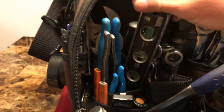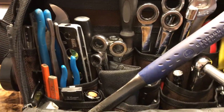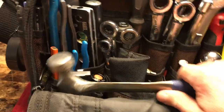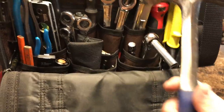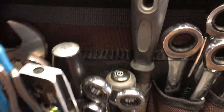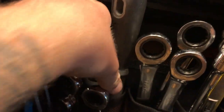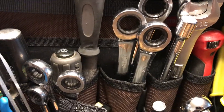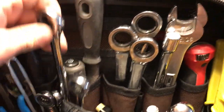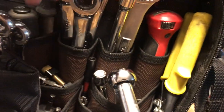I've got a pair of 420 and 426 Channellock pliers — the smaller guys — and those have suited me really well. I carry the Klein magnetic level, not the lighted one, just another variety. I'm still carrying the 20-ounce hammer even though it doesn't fully fit in this bag — once I get to my work area I pull it out and it's out for the rest of the day. I love the hammer and can't see myself going to a lighter weight. I've also got a Klein reamer and a cheap file that I don't even know where I got it, but it's done the job for a couple years without any problems. And I have all the combo ratcheting wrenches in all the different sizes — the only thing is the 13/16th and 7/8th are not ratcheting because I couldn't find them individually.